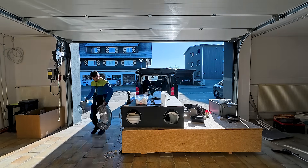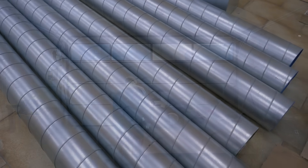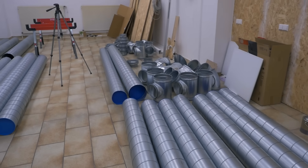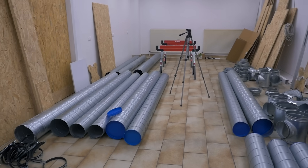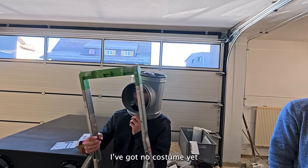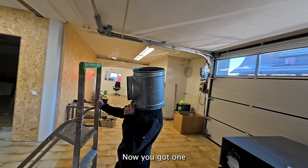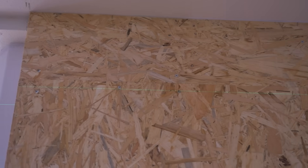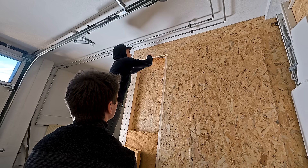Then we ran all the pipes to hook up the workshops — we have 250 millimeter and 200 millimeter pipes. A laser set high up showed us the upper installation height, and we also double-checked that all wiring is above that level.